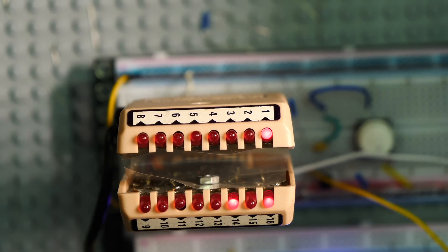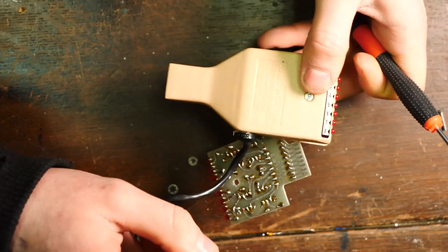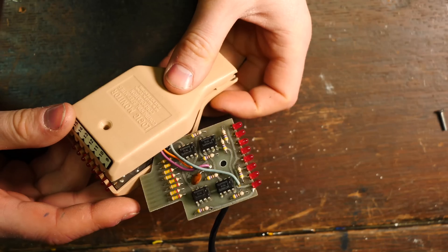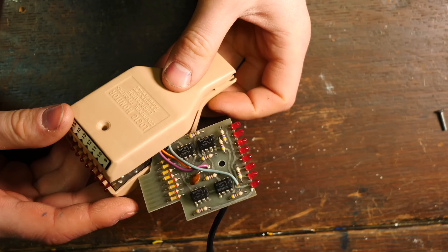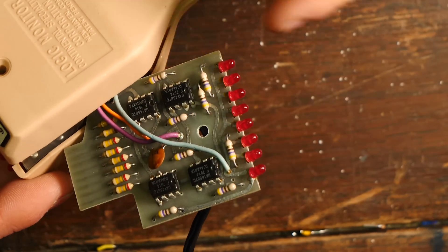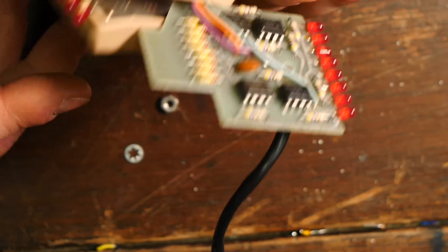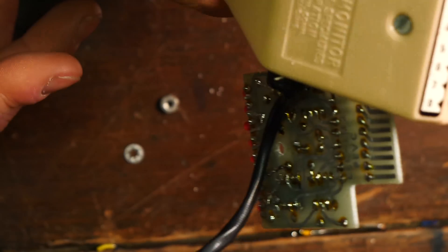It's exactly the same as wiring up LEDs on the breadboard, but just having a random dodgy design from the 1970s to do it with makes it just oh so much sweeter. So there's two of these circuits, one on either side. I'm really regretting taking it apart already because I really don't know whether I'm going to get this back in — it's that awkwardly put together. Each side is based on four UA1458TCs, which I'm pretty sure are dual op-amps. Each of these LEDs basically just receives the signal through some buffers — it's really that simple.